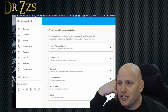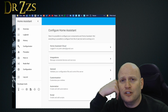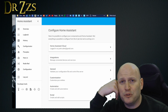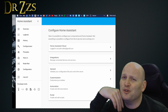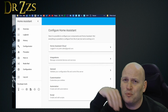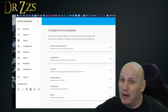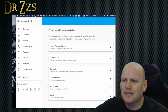All right, let's see. If we Tasmotize a D1 Mini, can we use 2 different GPIOs for different outlets? I think I understand what you're saying, and the answer is yes. If you flash a D1 Mini or a NodeMCU board, you'll have 11 available GPIO pins. You can hook up 4 switches, just because that's what you're limited to with the Tasmota firmware. You can go switch 1 through switch 4. You may be able to do some other things with buttons. They also have an option for buttons in Tasmota, so those might do something for you.